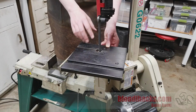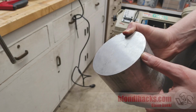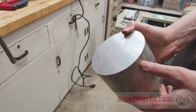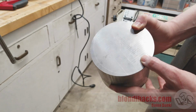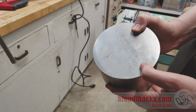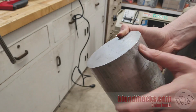But if you are going to be doing a lot of that kind of work, you are going to want to invest in a proper full-size vertical metal cutting bandsaw. Now you might be wondering, how well do those saws really cut, especially the cheap ones from the usual suspects? The answer is, from the factory, not great. But with a little bit of tune-up, you can actually get very good performance out of them. You can get nice clean cuts, nice right angles, and I've got a blog post, which I will link to down in the description, all about tuning up these saws to make them perform like little champs.